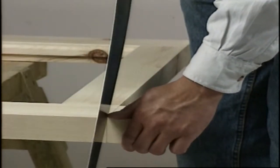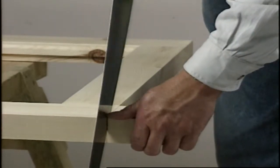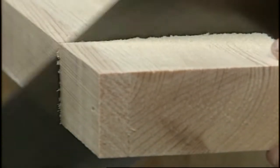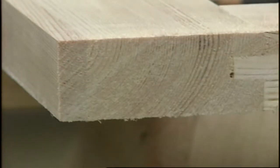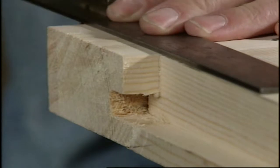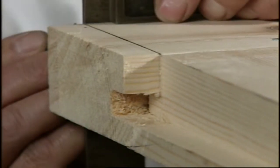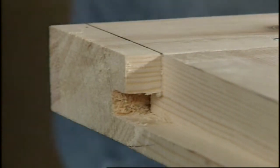Remove the top and bottom horns. In this case, the door is to be fitted over a water bar in the frame sill, and the rebate in the bottom rail is extended through the stiles.